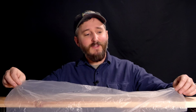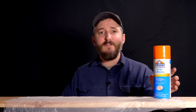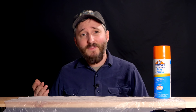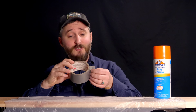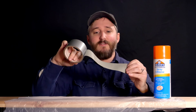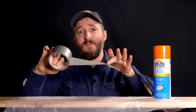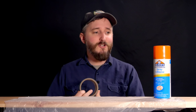Most things don't stick at all to this plastic. But one thing that does stick is spray adhesive — at least temporarily. Once the adhesive fully dries, it slips right off, but there's a sweet spot where it's slightly dry but still tacky, and at that point it actually has some grip. This sent me down a new rabbit hole looking for a glue that never fully dries, like the adhesive on duct tape, which also sticks reasonably well to this plastic sheet but is too heavy to fly. These non-drying adhesives are called PSAs — pressure-sensitive adhesives — and it's surprisingly hard to find them just sold in a can.